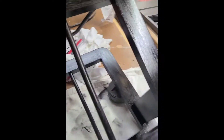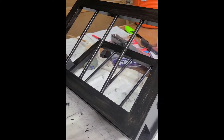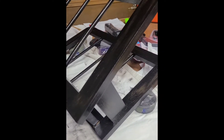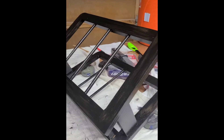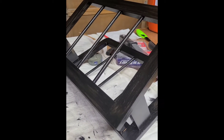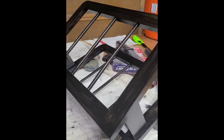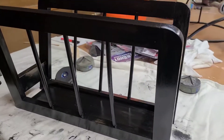The second coat went on much faster. What I did differently is that when I wiped off the excess, I didn't wipe quite as hard, so I left some of that excess gel stain on there to get a richer color — I'm really liking how it looks. It is going to take longer to dry because there's more excess stain on there, so I may need to leave it a full 24 hours before touching it. I'll see what it looks like after it dries, and maybe do a third coat.